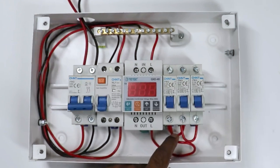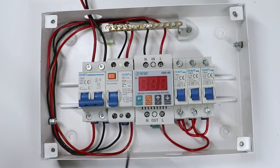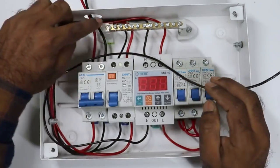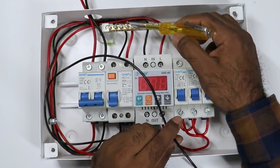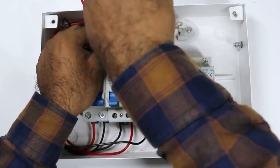So, I am connecting the wire with this terminal. Now, from the output terminal of this relay where you will get neutral power supply, connect a black wire. After this, take the other end of this black wire and connect with the neutral bus bar — this is our neutral bus bar — with which we have to connect neutral power supply. So I am connecting this also. All the neutral power supply needed in our home — all these connections will go from this bus bar only.